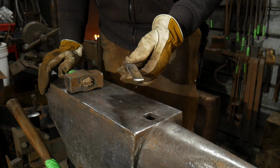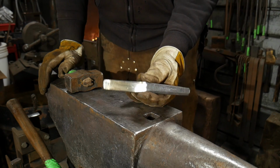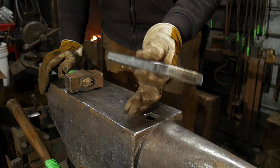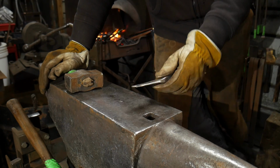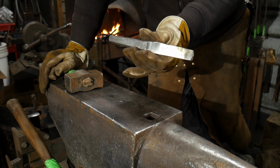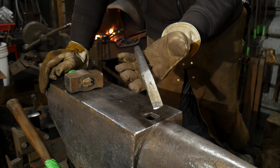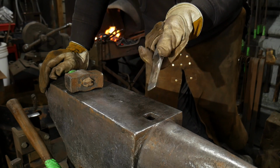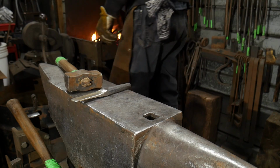We're going to be making the pocket in this welded joint with an H13 slitter that we have made a video on. I'll try to link that up in the description. I don't know which video will come out first. Most likely this slitter video will come out first before this video, so it should be linked up in the description. And if it has come out already, it will be right up here in a card for you. So go check out that video if you want to see how I made this little H13 slitter. It's a high carbon, high alloy steel that is really resistant to heat. So it's a great little tool to have in the arsenal. Been needing to make one of these for a really long time.